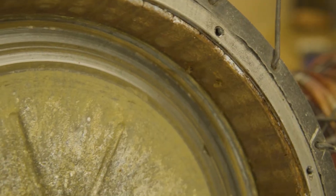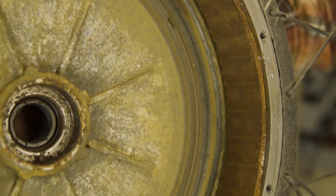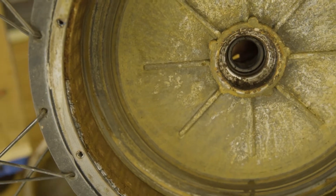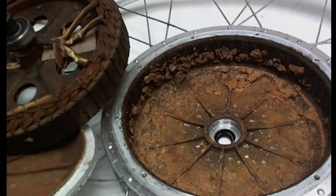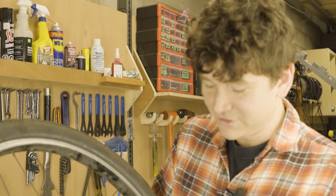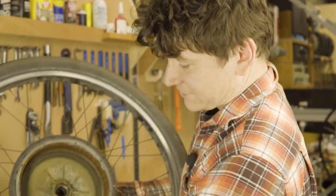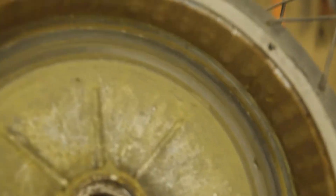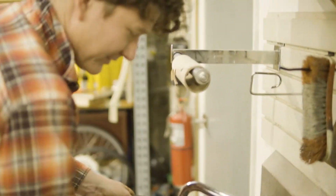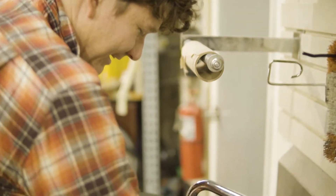If we have a look at the magnets, they're in decently okay shape. Sometimes water damage, if it's in there long enough, will really cut into the nickel plating coating the magnets and protecting them, and you can get some really swollen rare earth. If you see really swelled humps of rust on the magnets that when you clean causes the magnets to disintegrate, that could be a game-over point. But here it's mostly superficial rust that's come from the stator and embedded itself on there. Since there's no wiring or electronics I can be more aggressive, so I'm just using a Scotch-Brite style scouring pad.